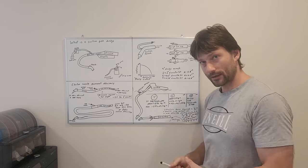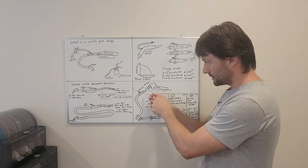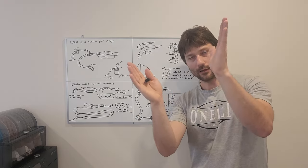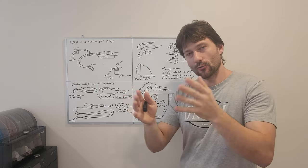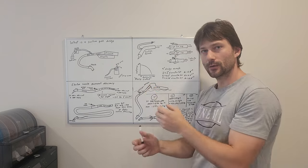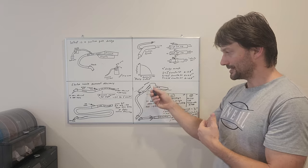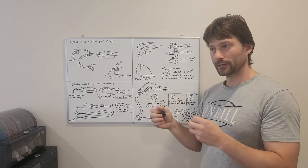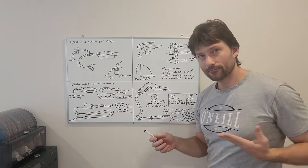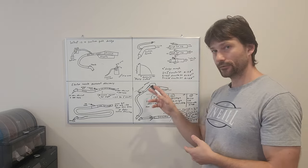One thing you can do is use a flare when you break the surface of the water. Instead of just a straight four inch tube coming up, you open that water up a little bit — as the water flares open it slows down, and you're harnessing some of that kinetic energy in the tube to help lift it above the surface. So putting a flare right as it exits into your sluice not only slows down the water flow for better gold recovery, but it actually harnesses kinetic energy and makes your suction more efficient — which is why flares are great.